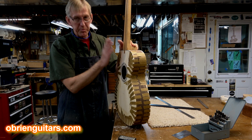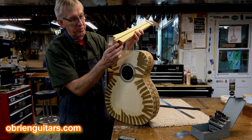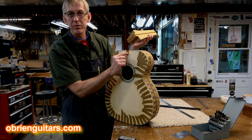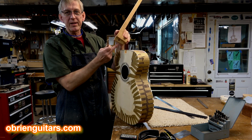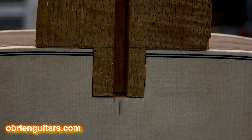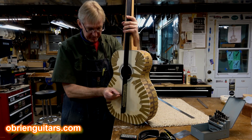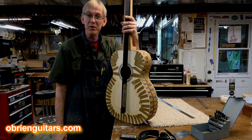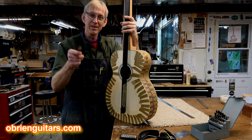We drove it all the way home and put it on the guitar body. I'm noticing a problem — my tenon is bottoming out in the mortise cavity. So I take it over to the sander and just bump the backside of the tenon. You can go about an eighth or a sixteenth in there — you don't have to go all the way down; in fact, I prefer it not to be all the way down. I ground just a little off the end of the tenon because it was too long. Now we place it in the cavity, come in and check our gap — I've got about a 32nd there where the mortise is just a hair short, which is what we want. Measuring at the saddle location — bingo, 3.5. Ryan, you did good. Congratulations. At this point you can go ahead and keep setting your neck: put your bolts on, bolt it on, check your center line — all the stuff I show in my online courses. Happy building, folks.